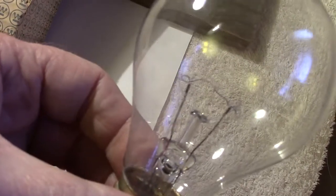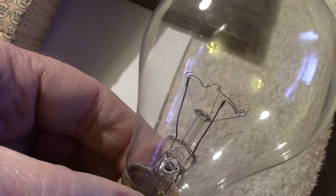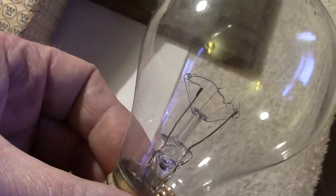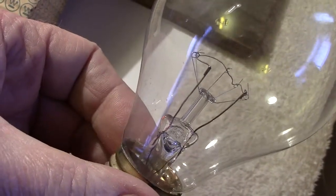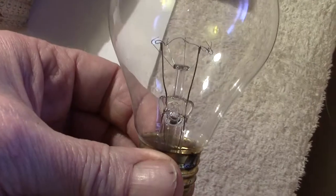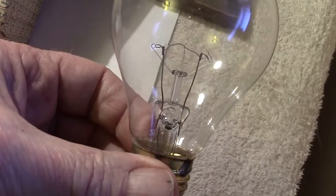If it was up too high, it would not be any good — but set low down, you can focus a beam of light straight out of the traffic signal. The English traffic signal lamps are exactly the same: they are like a rough service lamp but at slightly higher wattage, and the filament arrangement is low down like this. So if you ever pick up a lamp and wonder where it came from, and it has a low-down filament, chances are it was used on a traffic signal.